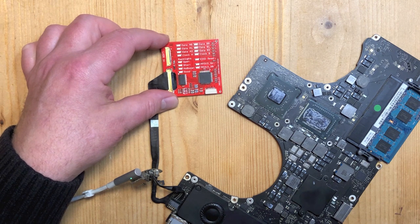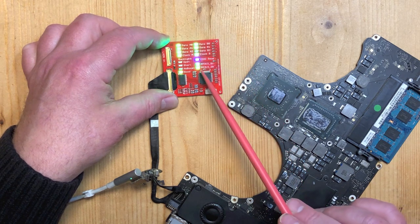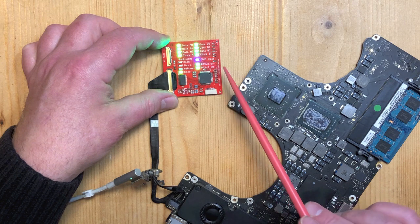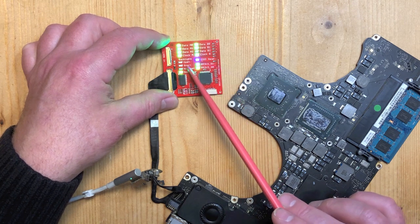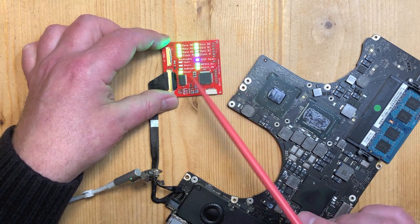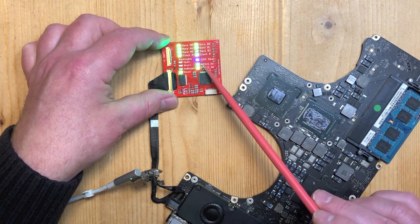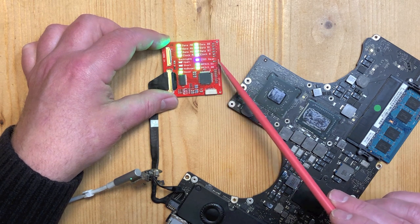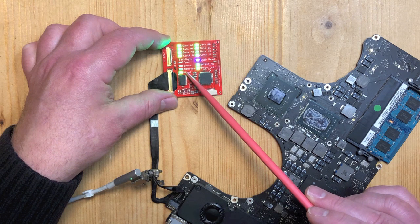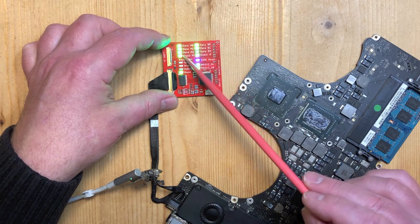The MagSafe light is lighting green. First it was showing the PP3V3SO and it was not happy with the backlight yet. Then it read out the EDID ROM, which was about the same moment the machine went 'boing'. Then it turned on the power to the pretend screen. The backlight is now showing green and good, and we're getting data on all eight channels.